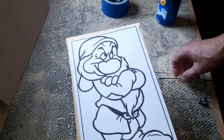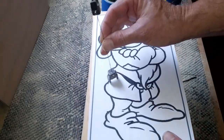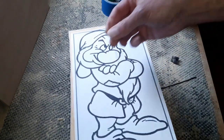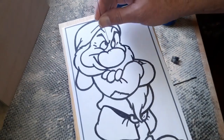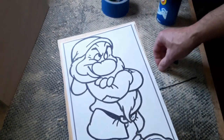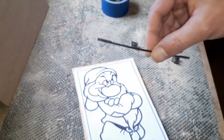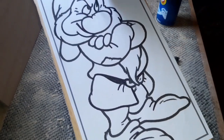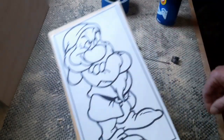So to feed your blade through, no matter what blade you like to use, I will be using a Pegas spiral blade today. They can cut them round in any direction. You can get pinless blades. Ideal for this project because they are small, there's no pins in the way. And when we get into the smaller sections, like the eyes and inside the buckle on the belt, they'll go in no problem. And even with this one, they get pin blades, you get pins at both ends. You might just get away with this one, I can't see any. You'll just squeeze that in there, I would have thought, and into the eyes. But for delicate, you want pinless, or for me, spiral blades.